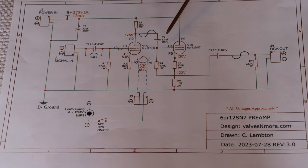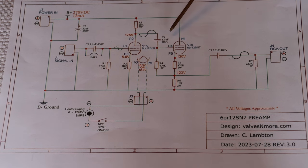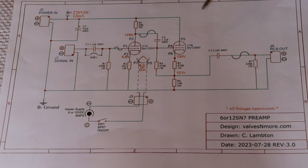Normally, coupling caps have a fair amount of extra room in their specifications, and that's important. The value of the cap is a more complex discussion, but you need a value that will allow the entire audio band to pass cleanly without any chance of filtering. Our standard design preference is to go very wide band — well outside of the audio band — and 1.1 microfarads is actually a lot larger than needed, but sonically it sounds amazing. We should also give a shout-out to Paul at PS Audio, who talked about this quite a few years ago. He does a daily blog that's worth checking out.